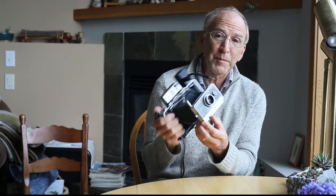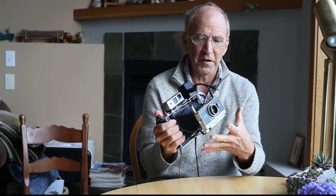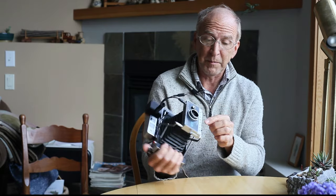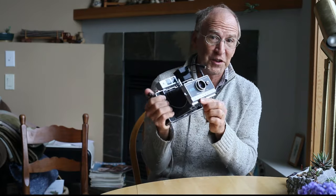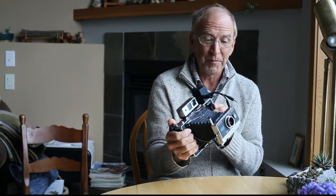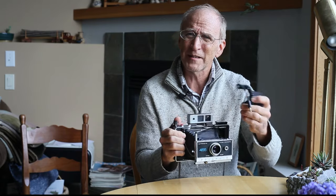I had to make one compromise, and it was a frustrating one. When you switch between apertures, sometimes you have to switch the scene selector switch, and when you do that, all of a sudden your thirtieth of a second becomes like an eighth of a second. That's because the internal electronics adjust the shutter speed based on the scene selector switch. When using manual shutter speed, I always had to compensate two stops when set for sunny day. It was confusing, and I definitely didn't get the exposure right on a few pictures before I got used to it.